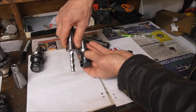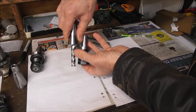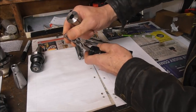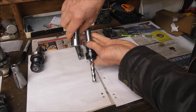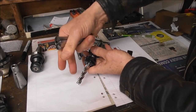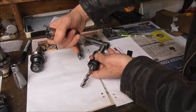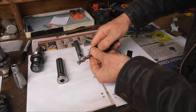You can see that the cutter is in much closer to the spindle bearings — the spindle bearings are up here versus up there — so look at the difference: it's a huge difference. The projection has a big effect on tool stiffness, and the play in the bearings, the flex of the tool, and the runout of the cutter holders all have an effect. The further they're out, the worse it gets. If you can get your cutter in close to the spindle bearings, that's a big advantage.